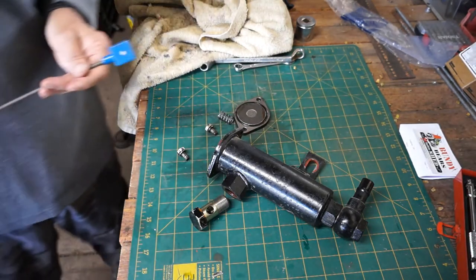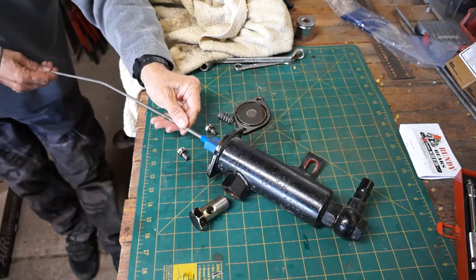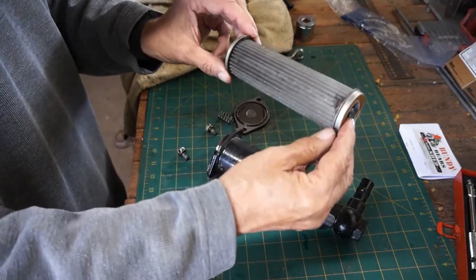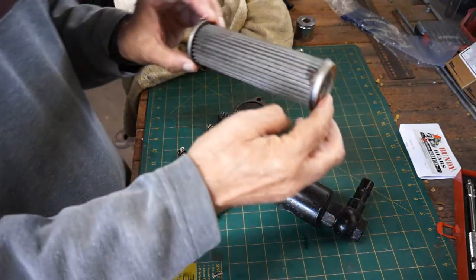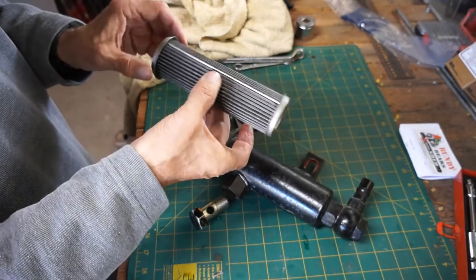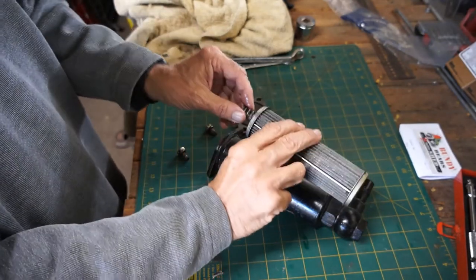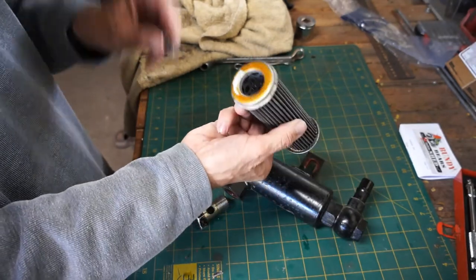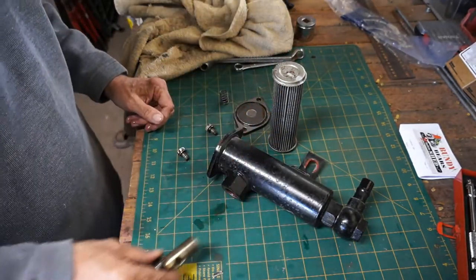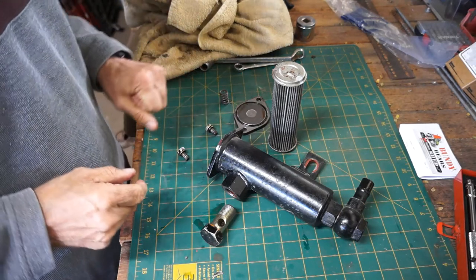I kept these two-dollar reject shop tools for a reason — it's a magnet. You can see it's a lengthy thing, about six inches long. I'm going to clean that in petrol as recommended. There is a bit of gunk on there — I'm glad I had a look at it. Take note: it goes in with this solid piece to the outside, that's how the spring will keep it in. You'd be dumb to go the other way — although I've done dumber things than that. So there's the strainer and the hollow bolt that goes in underneath. I hope that makes sense.